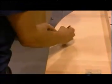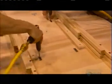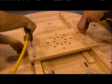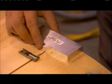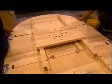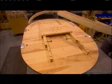After marking the position of the apron, workers screw in steel braces to level and align the three sections of the table. This table will have a pedestal base rather than four legs. After installing a part called the assembly plate, they lay down a series of metal templates. These ensure that they mount the apron precisely.